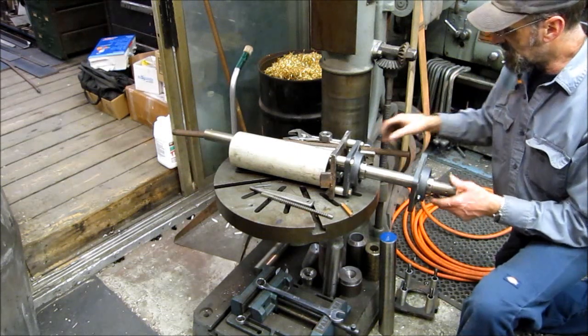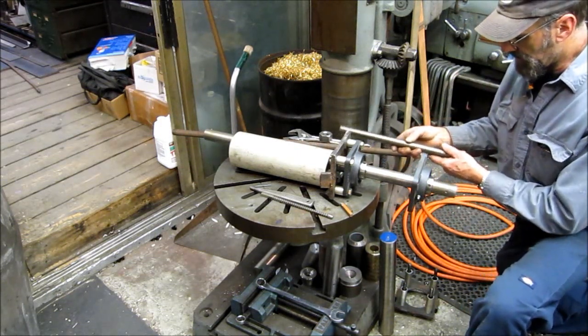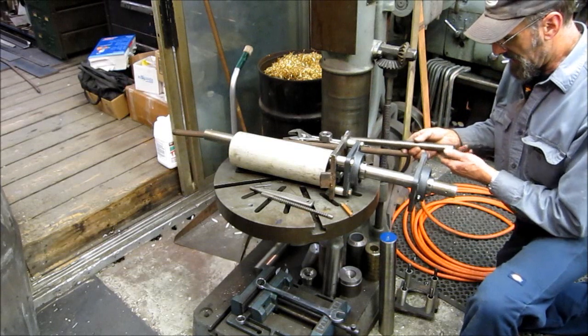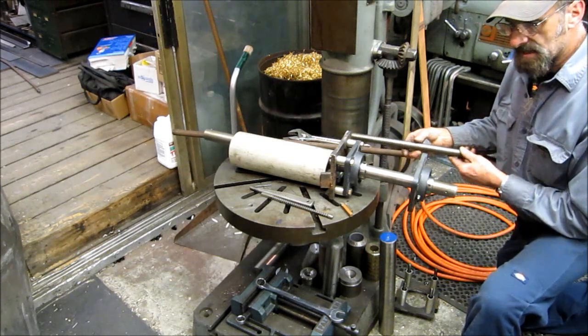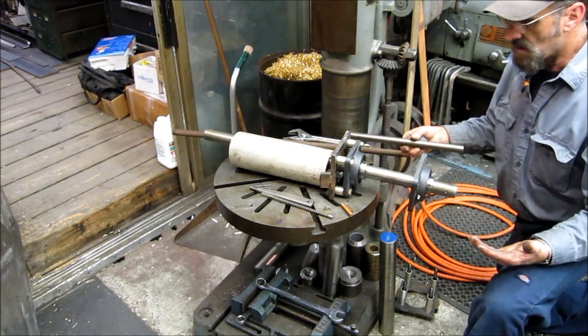And this plate could come over, and you could actually have an Acme thread that would be thrust-mounted to a fixed point, and then have an Acme nut welded in or tacked onto this plate, and then you can rotate this like a regular lead screw on a mill.